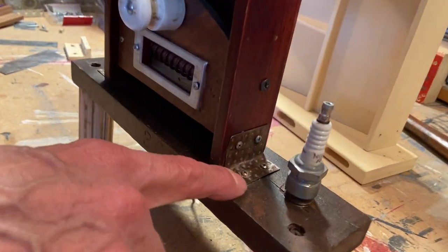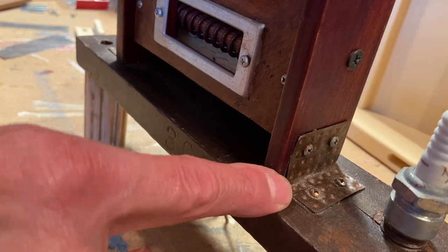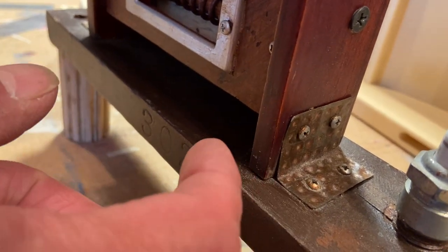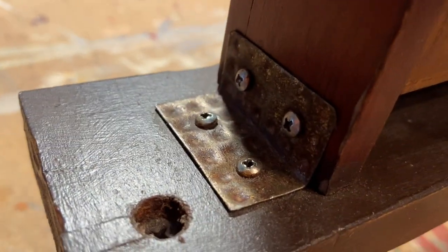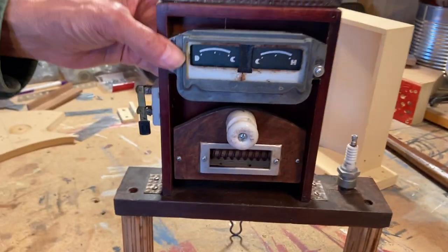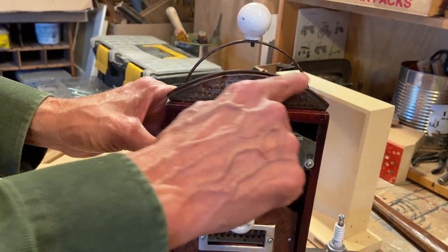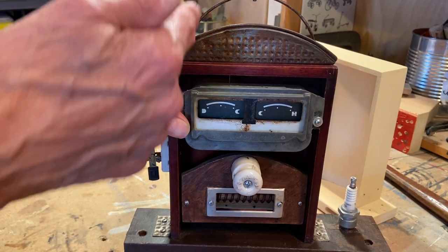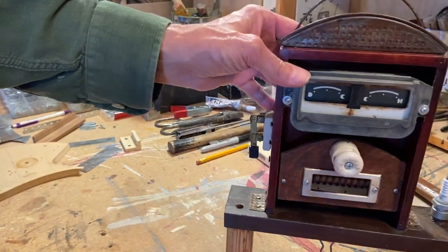You can see here there's a piece of metal bent at a 90-degree angle with four holes drilled — two go into the base, two go into the side — and on the other side, another very similar set. That holds it together. I've used materials I've previously used on the piece at the top: this curved piece has kind of a waffle texture, and that adds continuity to the piece for design continuity.